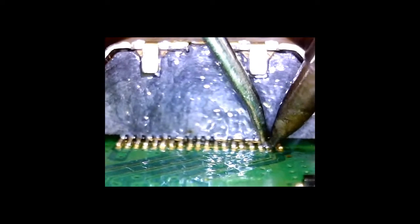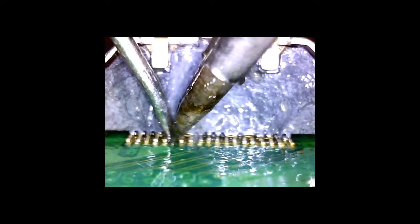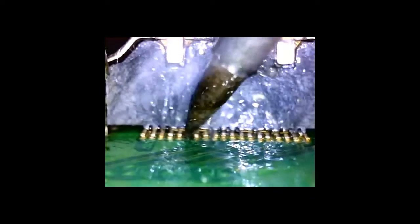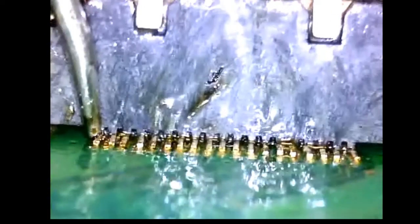Okay, so some of these were only soldered at the very tip, which allowed the colder soldering iron to let it go down. Now watch here. I think I poked that one leg again just to double check it. Yeah, see how that one leg's moving? Here I go back to try and hit it again, and it just wasn't working. See, loose again. I tried to go directly on the top. That didn't work. I cut that short, and you can see where I just kind of tapped on the plastic there. Very little.